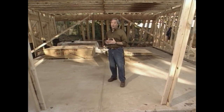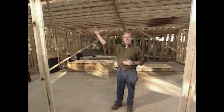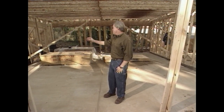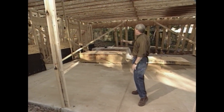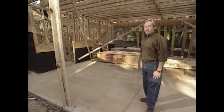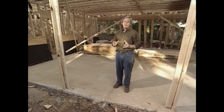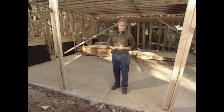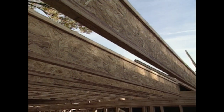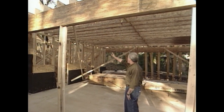The homeowner plans to utilize a large attic space that will be created when the framers build the big gable roof. To access that space, we've created an area between the two storage areas for a staircase that will turn and reach up to the upper level. To accommodate the extra weight in the attic, we used special wood I-beams for our ceiling joists — 12 inches tall, placed 16 inches on center, pre-engineered to span the area.